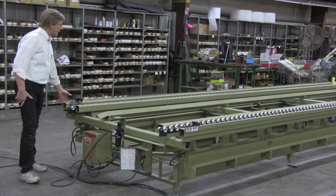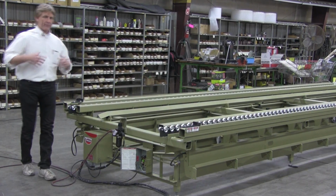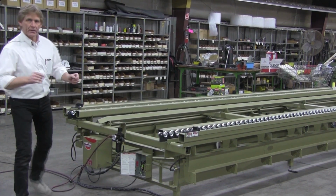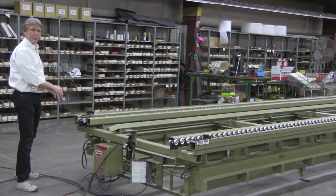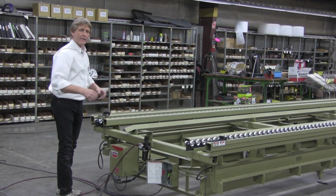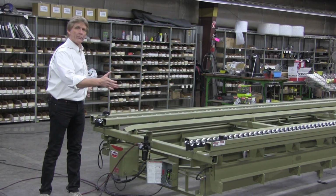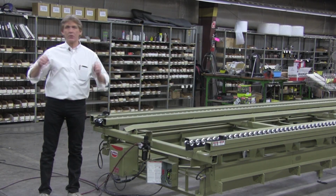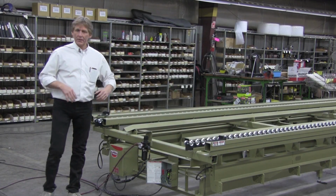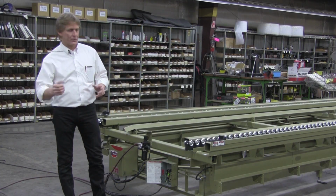The left side of the screen, this is the adjustable side, so this side actually runs in and out. If you're going to do a table from, say, 8 foot, you can go from 6'9" to 9'3" to 10'3". If you want to go to 12'3", we can do that. Both sides adjust to do that. If you want to go to 14, 16, 18, and so forth, you can get one of our other tables. It's not a Diamond Quad style; you can go to one of our Gen 3 style tables. If you're going to do floors, really tall walls, balloon walls, and things of that nature, we can help you out with those also. That's different machinery.